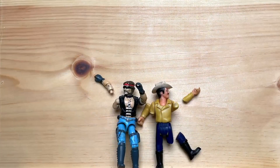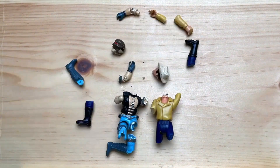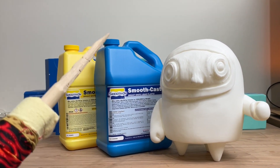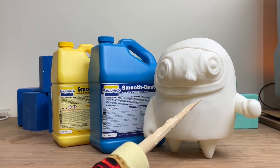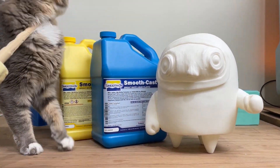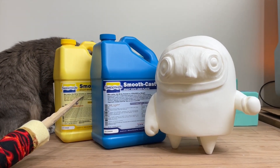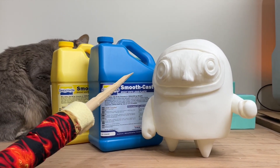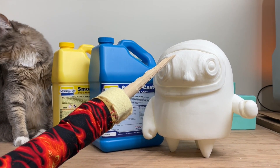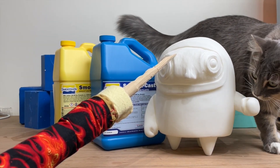Could I mold my sculptures up in a bunch of different pieces and then assemble them after casting? Yes, but that is an excessive amount of work. There's also the issue of volume — casting a large piece in solid resin would just be ridiculous. This is a 2-gallon kit of casting resin that costs $120, and when I did the math, the volume of this piece is 1.35 gallons, so this piece would be about $80 worth of casting resin.